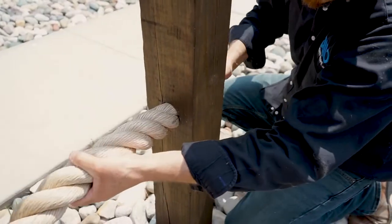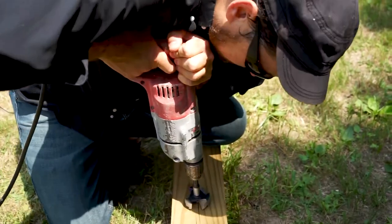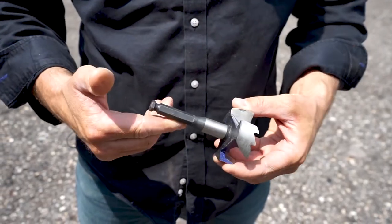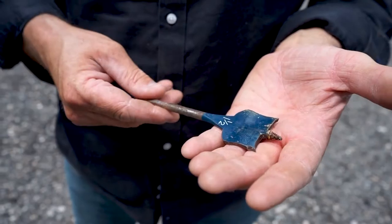Let's look at how to attach the rope to the post. If you're using square posts, the cleanest look is achieved by drilling holes and running the rope through the posts. This also uses the least amount of rope and doesn't require any special hardware. You will want to mark and drill both sides of the post and have your holes meet in the middle so that you don't blow out the wood on the back side when the drill makes it through. A drill press is the safest way to drill these, but if your posts are already installed, you may have to use a heavy duty hand drill. We have found that the best drill bit to use is a threaded Forstner bit. You can also use a hole saw, but you'll have to chisel out the slugs, or you can use a spade bit — that works nicely if your rope diameters are smaller than one and a half inches. This project is using two and a half inch pro manila rope and used a two and nine-sixteenths Forstner bit.